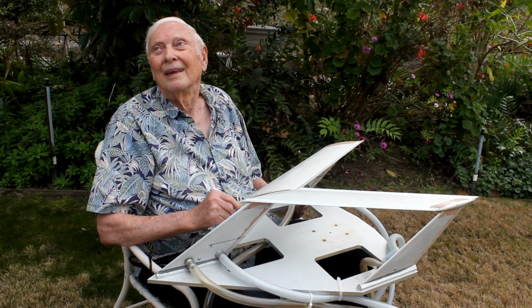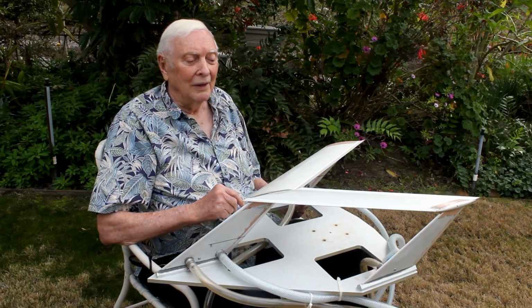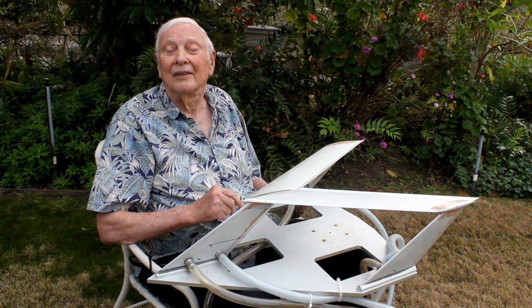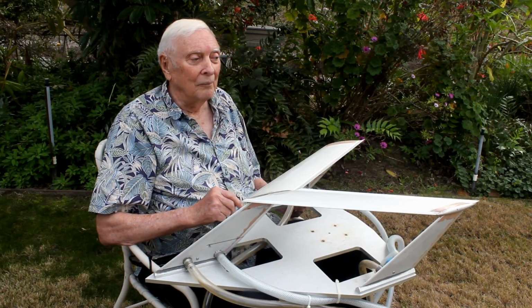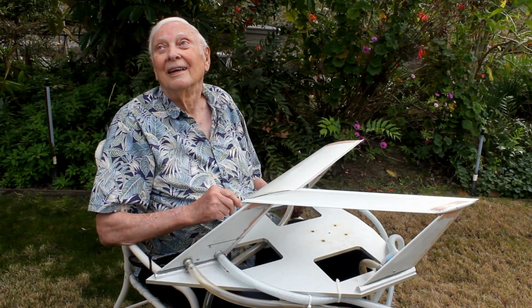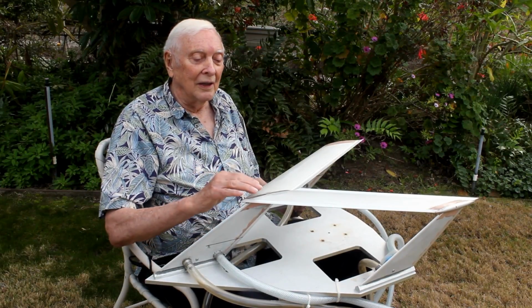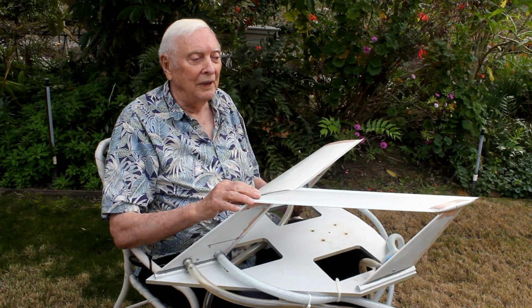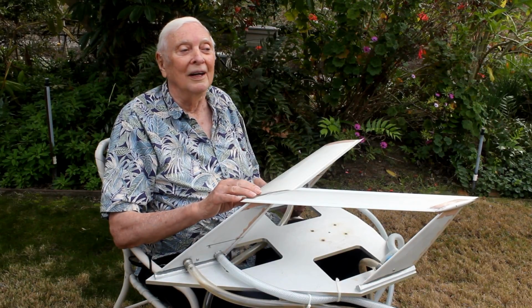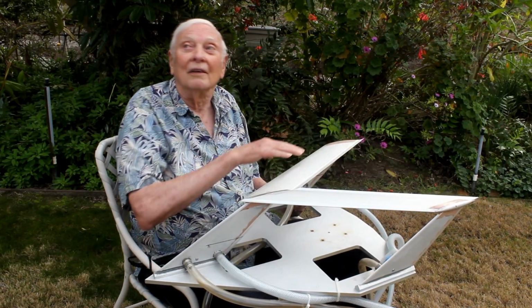And am I correct in remembering that you said a full-size model could be made of that, that would be a ship that would cross the ocean at a very high speed? Yes, it would. It's designed to go about 100 knots for a distance of anywhere halfway around the world in 2 or 3 days. And besides speed, what are the other advantages? The other advantages are that in waves up to, say, 15 to 30 feet, this would give a very near level ride, and it's because of the sweep back on the V.